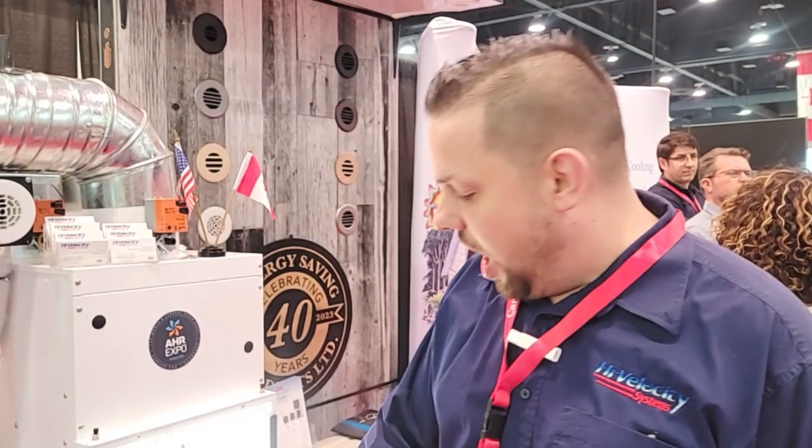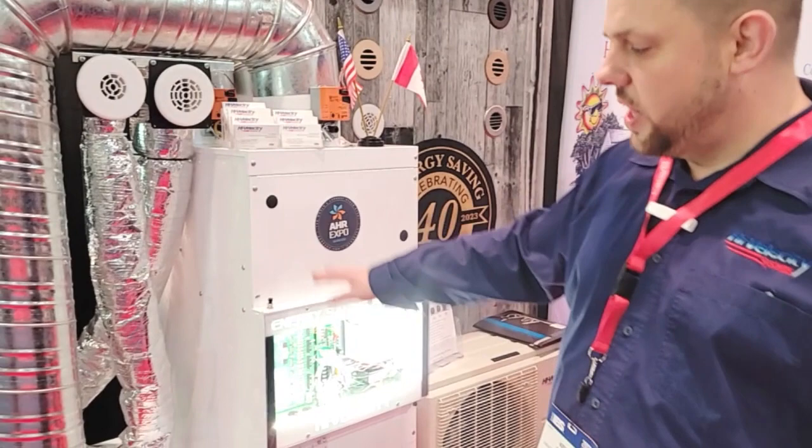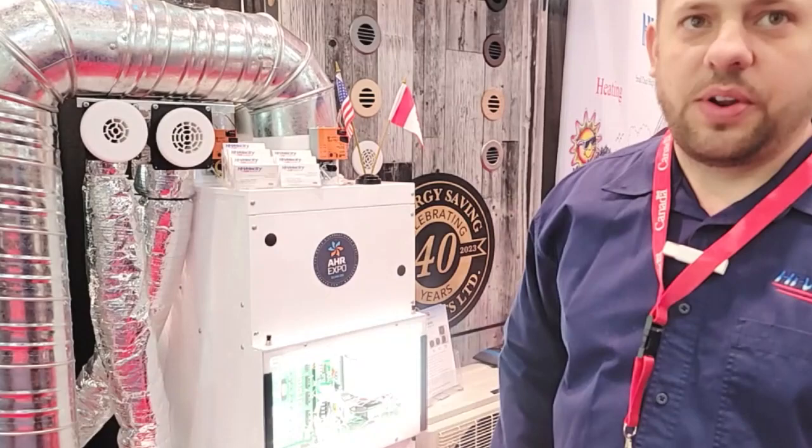So the filter's first, and then you're looking at the other systems after that? Exactly. Our system filter and cooling coils are on the return air side of the system, and then our hydronic heating coil is on the supply side of the fan, and then your main plenum, and then you branch off with your flex duct to your different rooms.